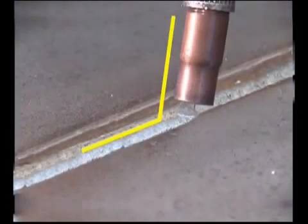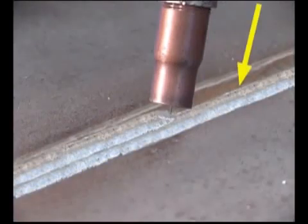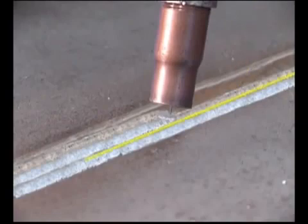To cap a wide bevel, overlap weld beads side by side. With the wire feed gun angled a little to build up weld, use the edge of the bevel to keep the bead straight. Then use the inside edge as a guide, adjusting the travel speed to allow the puddle to flow almost to the middle of the first pass.